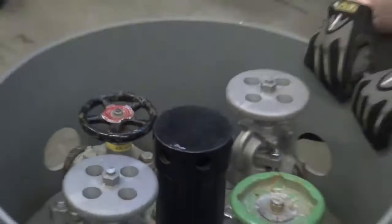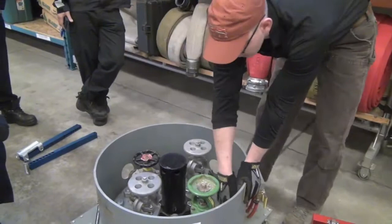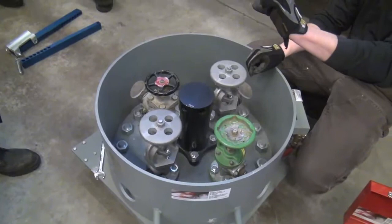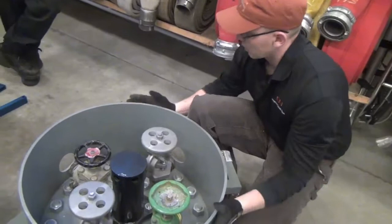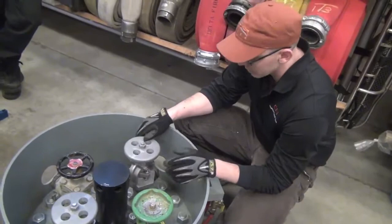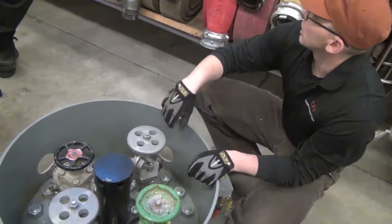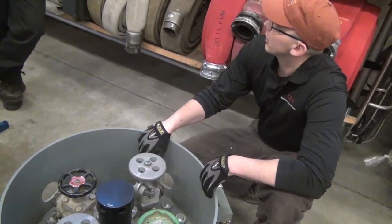When we start getting into stranger things - especially when cars really take a big hit in a derailment - the big studs inside the housing, the pressure plate on top of the car is nearly an inch and a half thick. If the housing takes a really big side shot in a derailment, sometimes the studs will stretch and we can end up with a leak at the pressure plate. Once you get a socket on those, get the biggest cheater bar or a torque multiplier and get on them with all you can in a crisscross pattern. We have had some cars seal back up when we did that, though others you never really get ahead of.